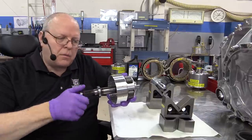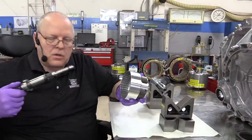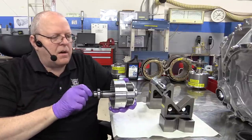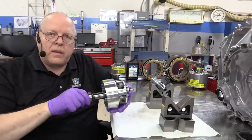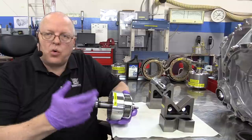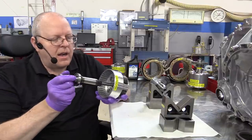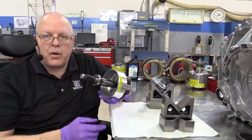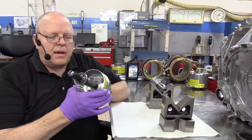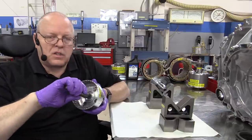I want you to see that I can rotate the input shaft inside of the planet carrier right now — there is no direct connection, it's just got a bushing fitted up inside there. Normally they'll turn the same speed, but it can slip if there's excessive torque. In order to make the input shaft connect directly to the planet carrier as it should, we have to connect it through a great big torque-limiting clutch pack that fits in here.